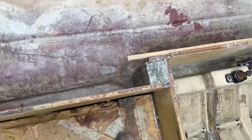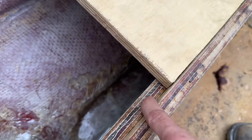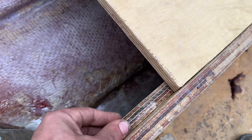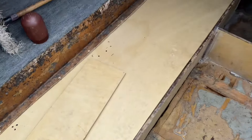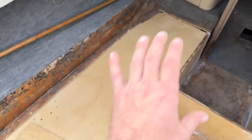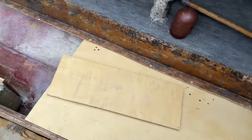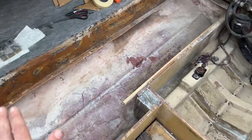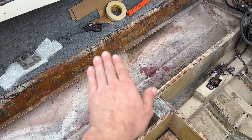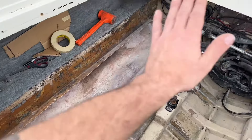Once we mix up that cabosil, we place it here on the pedestal so you guys can get an idea of what it looks like. There's the floorboard sitting on the pedestal. Cabosil will go on the bottom portion and on the top portion here. We'll set the floorboards down, screw it down, and let the cabosil kick off. That will basically fuse the joint — the floorboard to the actual stringer — and that will be solid. And once all of that is said and done and I lay that last board in there, on a little pedestal, I'll fiberglass that all in as one unit.